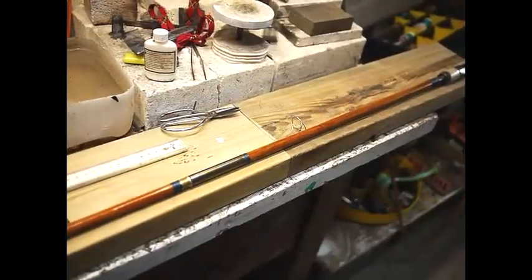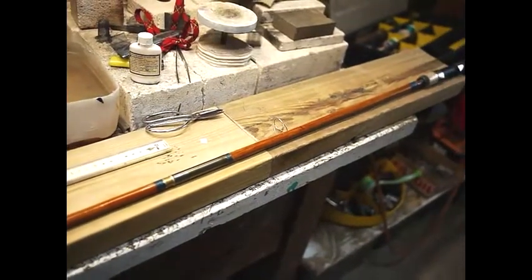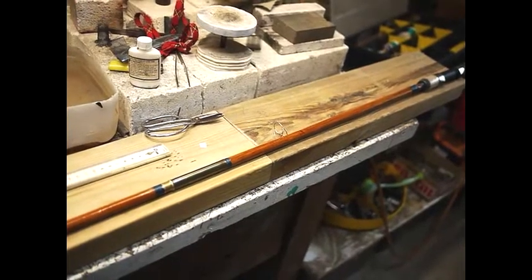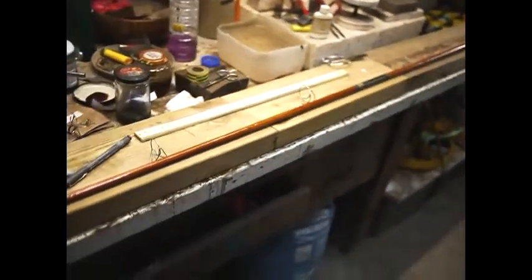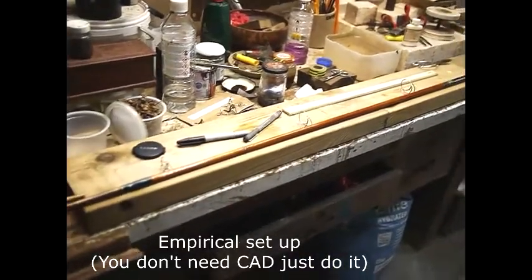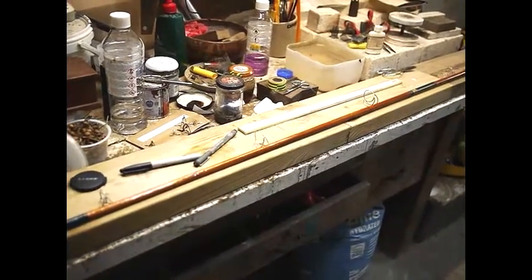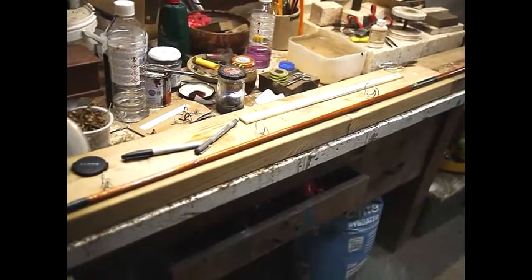You can see where the rod rings are. That small one at the end there is going to be about 45mm when it's installed — I've just put that one there as a placeholder. I'm going to try to get the whole rod in view. We've spaced the rings entirely empirically, so there's no actual measurements going on here, it's just an empirical guess at where they should be, and it does look right.